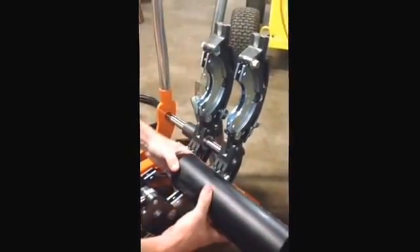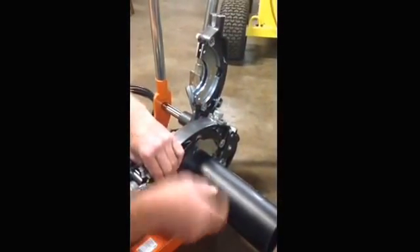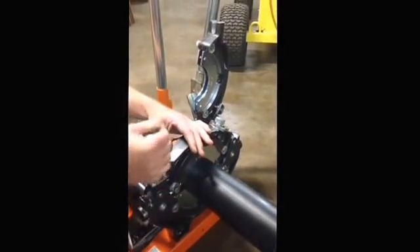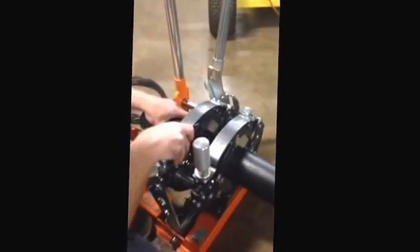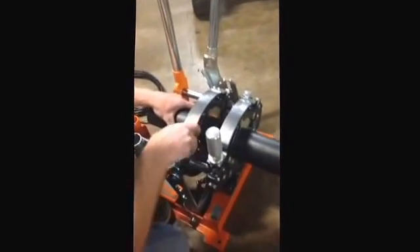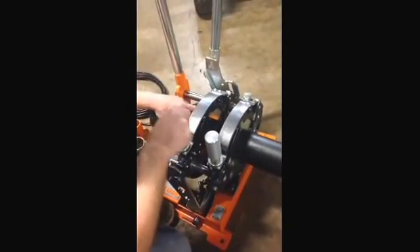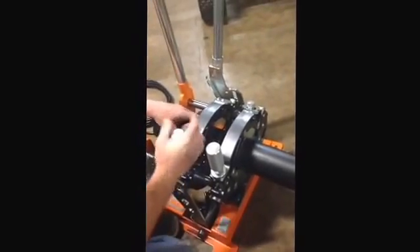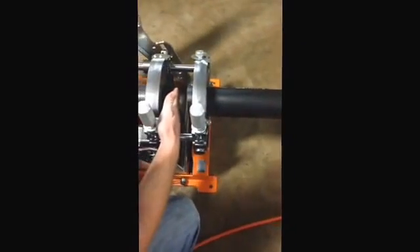To install your pipe you want to leave the pipes about an inch out from the face of the clamp. Tighten them in snug, but you don't want to really bear down on the clamps because you could cause the pipe to become out of round by crushing the pipe. I mean, reasonably tight. The machine itself has a spring loaded carrier that helps keep contact during the fusion process.